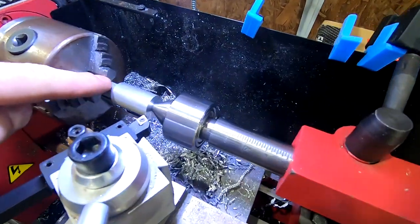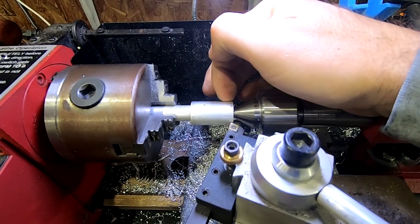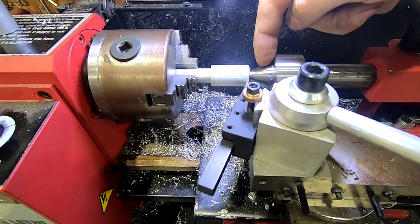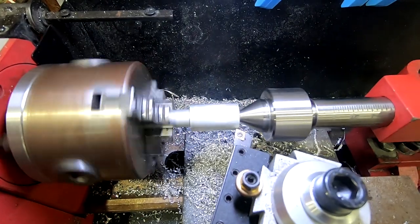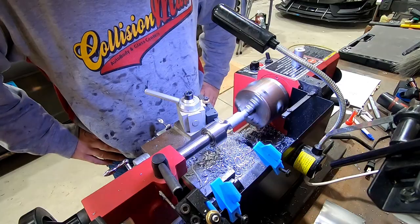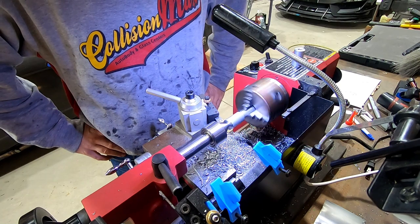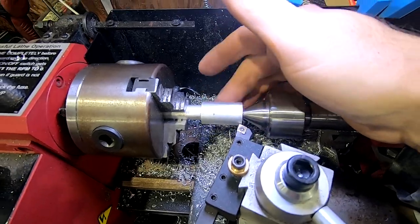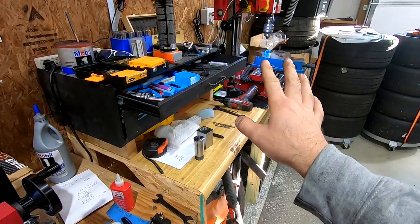I had a change of plan as I was turning down this little mandrel. The quarter inch stick-out I think would have been much too flexible. So what I'm going to do is basically turn between centers — I have my live center here. Now I can get this whole face in one shot. I mic'd them out and I need to take about five thousandths off the diameter on all of them. Then we're off to the mill — I've got my collet block ready to go. We're going to drill, slot, and do everything on the mill.